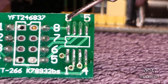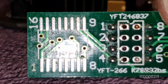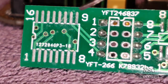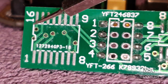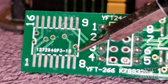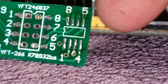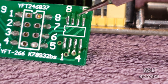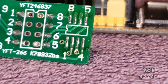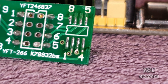This is your problem right here. On the left side you can see everything looks great — the pads are really long because I have never soldered chips there. You can see how the pads should look. But on this one here they are just some kind of destroyed — they are only about half there, the rest is missing.